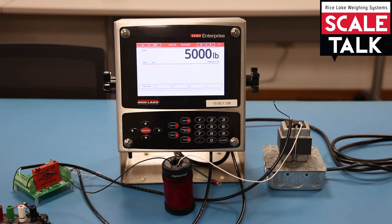In a free-running set point, or a set point configured outside of a batch routine, these are always being evaluated. It doesn't matter whether a batch routine is running or not — the scale is going to be looking at what the criteria is based on those set points.